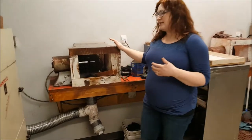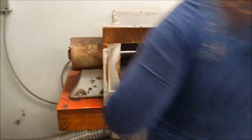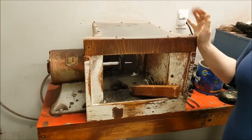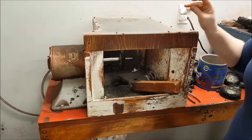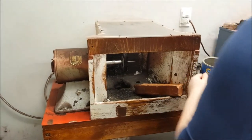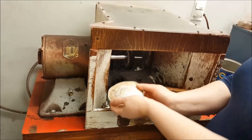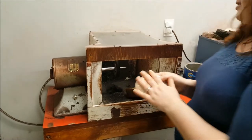So these are our polishing machines and unfortunately when they get turned on the person actually stands right in front so you can't see anything. That's why I'm not actually going to film it running today, but we add a little bit of our special polishing compound onto the wheel, turn it on, the wheel spins really fast and you hold the buckle up against the wheel at varying angles and degrees to polish it and remove any dull spots or last-minute oxide.